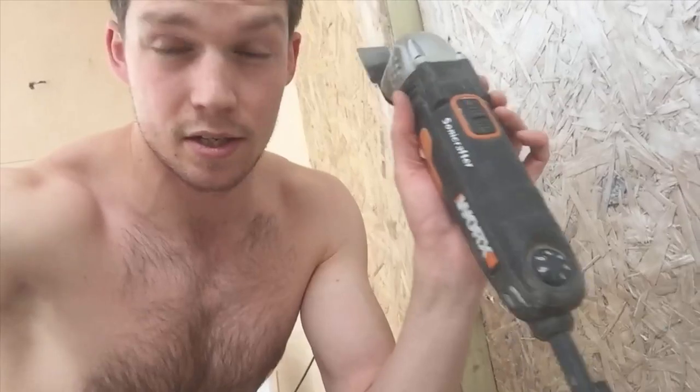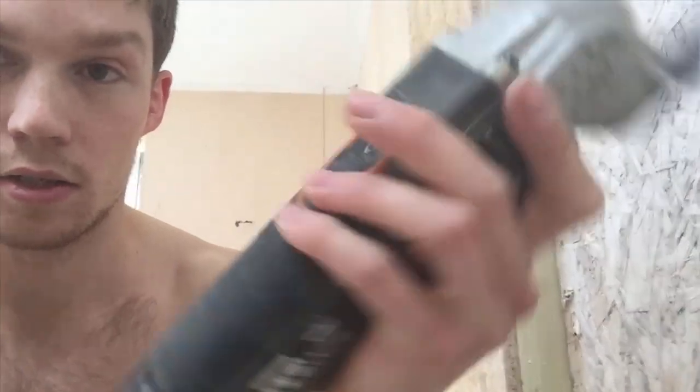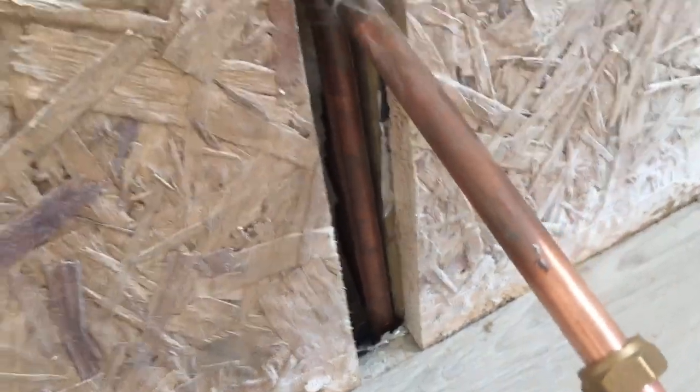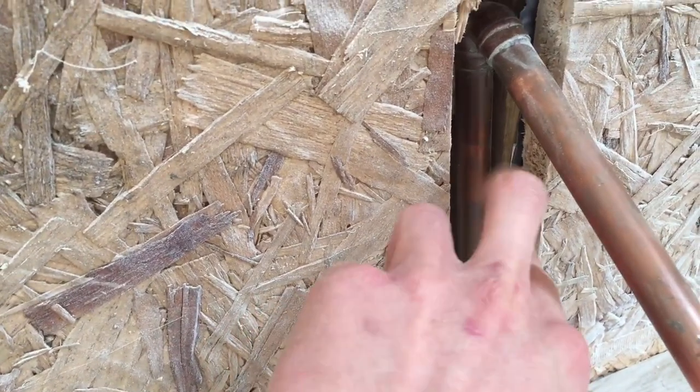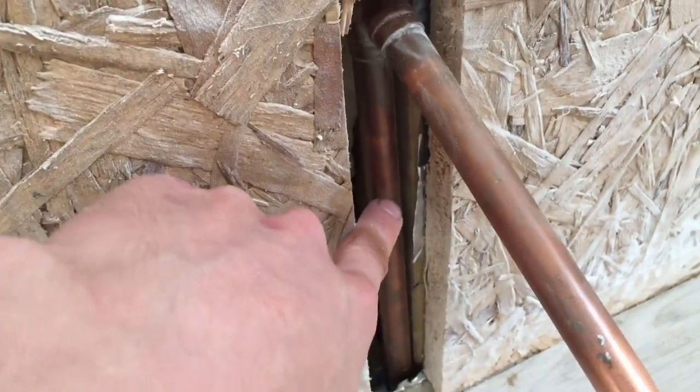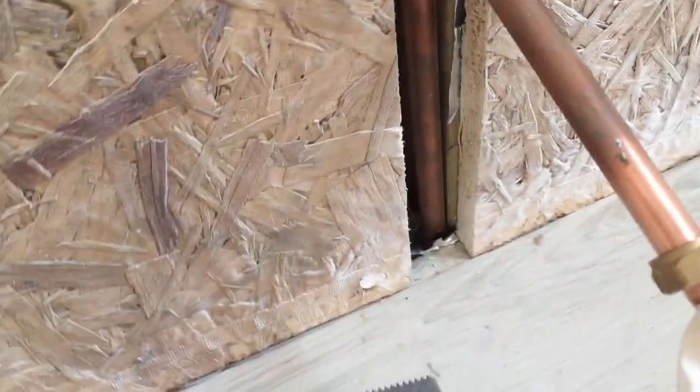Once you've got that all drained, here's my little secret: get yourself a multi-tool with a flat cutting end which cuts metal, wood, and plastic. Because copper is such a soft material you can cut through it quite easily, just like aluminium, with these carbide tip cutters — I'll put the link in the description. I'm going to be chopping mine halfway down here and putting a coupling unit on, because if you put these joints too close together you'll have them both melting at the same time when you fire up the propane flame. I'm going to be cutting mine here, catching all the water with some kitchen towels.